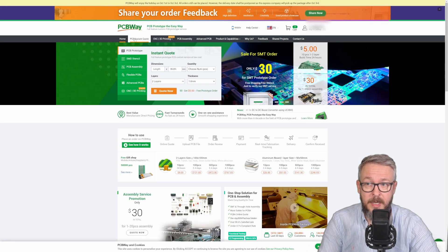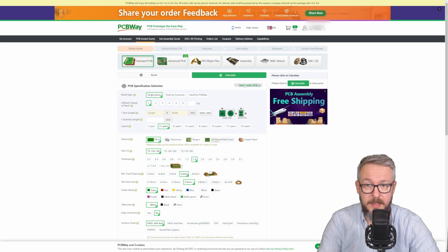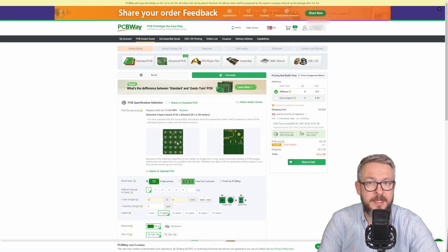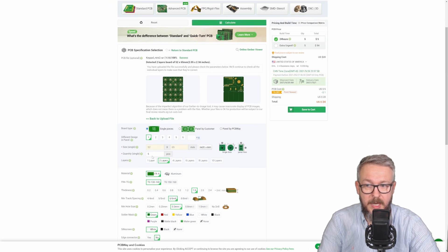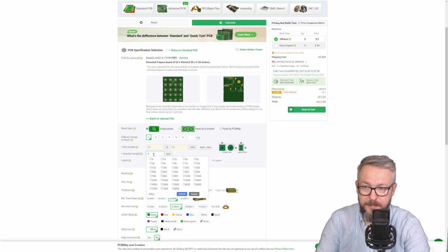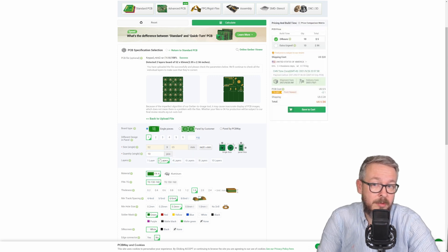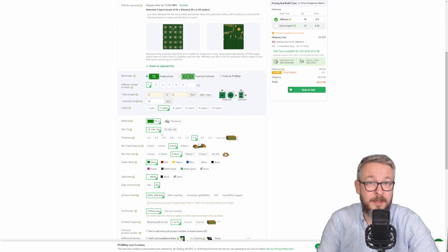Let's start preparing for this order. Go to PCB Instant Quote and select Quick Order PCB. Add the Gerber file — these should be the files you downloaded, called keypadmini2.rar. Open them and let them load. You can select if you want to order 5 boards or 10 boards. I always order more than needed because I'm not the best at soldering and might damage some. The next step is to select thickness — don't make my mistake, select 1.2 mm. I also recommend selecting the color of the PCB; for this project I selected black.